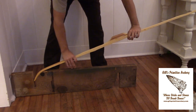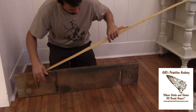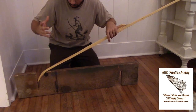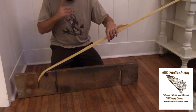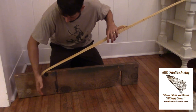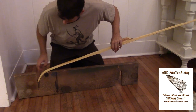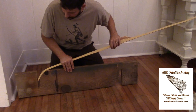It's a fast process, and that's pretty much it. What I've got here is a form I made — it's basically just a radius cut into it. This is an 8-inch piece, this side's a 10, and I also have a 6. The 8 is just average, something I normally work with. The 10 is if I'm working with an extra long bow or trying to make specifically big sweeping recurves. The 6 is if I'm using a very short bow. The size doesn't really matter that much — it's mostly what appeals to you. When I'm doing a full recurve, I cram it right down in the bottom and bend it all the way over and clamp it down. I don't have a separate form for my flip tips — what I do is simply just don't put it in all the way and I can kind of eyeball it. I've done enough of these that I pretty much just eyeball everything.